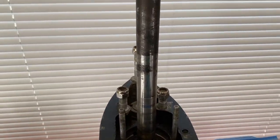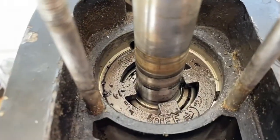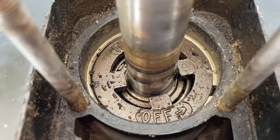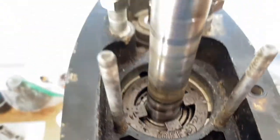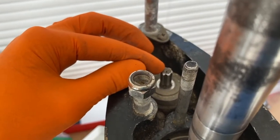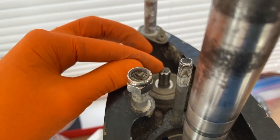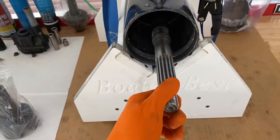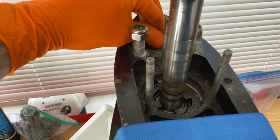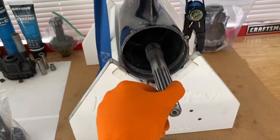Coming to the top of the lower unit, there is the driveshaft, and it feeds all the way into the actual driveshaft retainer nut and into the lower portion of the unit. You can see the word 'off' with an arrow pointing counterclockwise to loosen. Right behind that is our shift shaft. Before moving on, we want to verify that the entire lower unit and gear settings are in the neutral setting — not in forward gear nor in reverse gear. In our case right now, it is in gear, so we are going to come up top and shift it counterclockwise away from gear. The propeller shaft is now in neutral, not in reverse nor forward.